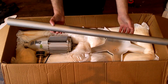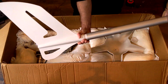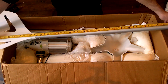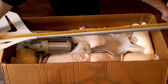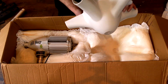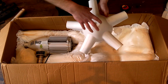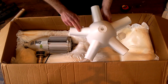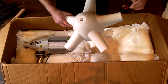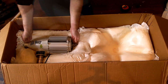This is the tail section — it slides in like so and it's quite long as well. The overall length is 126 centimeters, which should be a nice guide to control the direction of the turbine. The central nose cone is an update on some of the previous models. The older Istabreeze models only had a small cone in the middle, whereas this one has extra pieces to cover the ends of the blades, which is a nice touch. Then we have the center cap which just attaches on to keep it nice and tidy — a nice update on the older models.